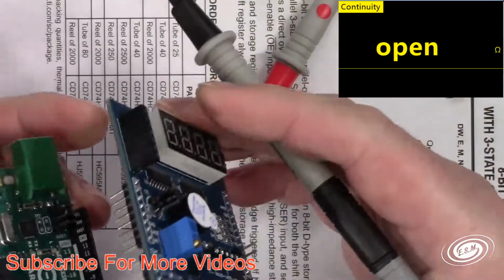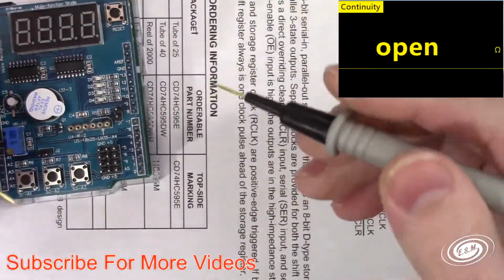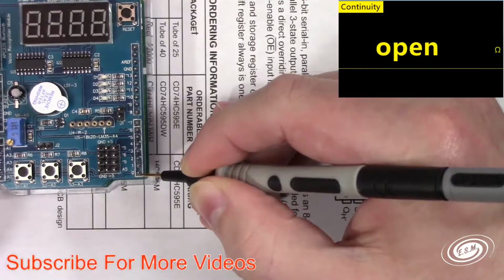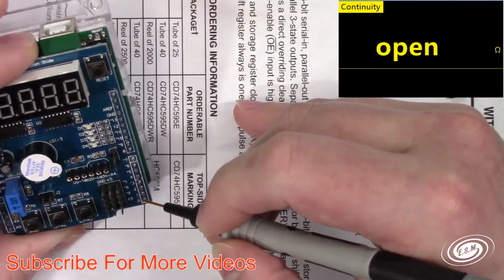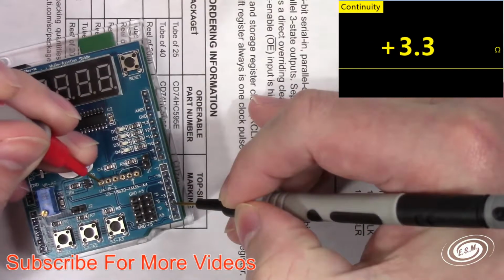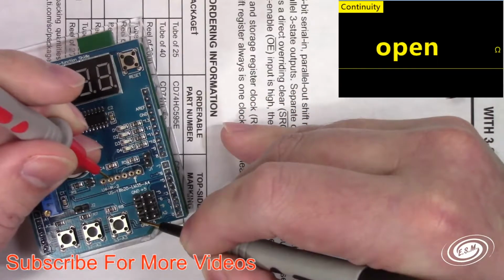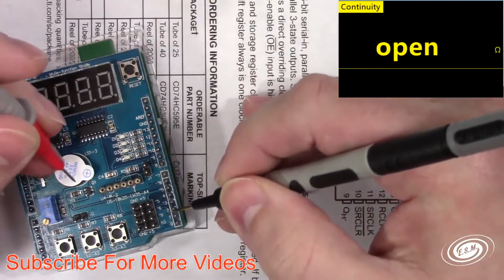Now I wonder, hold on a second. Let me just check something here. Looks like an A0 track. Possibly a pin 2 track comes to here, maybe. So that goes to pin 2. Not sure. That's an interrupt pin. Is any one of these powered? That's ground. That's 5 volts. So that could be an external button input going to pin 2.